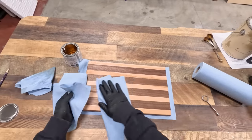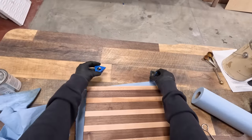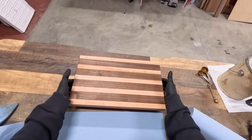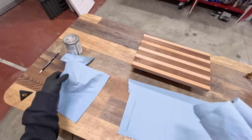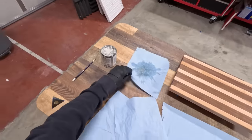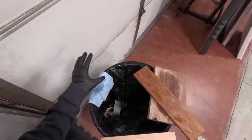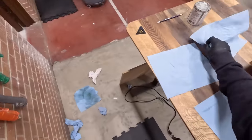I'm going to let this dry overnight and apply another two coats with a day in between. I do want this to get air on all sides, so I'll set up a couple of these little painters pyramids — keep the show surface up just in case these put a little divot in there. Also, just a quick safety note: anything that has touched that oil, you're going to want to let it dry in a single layer. I just drape them over the garbage can and let it dry. Only after this is dry to the touch will I crumple that up and throw it in the trash — you have a little bit of a fire risk there with spontaneous combustion.